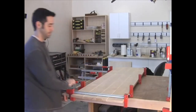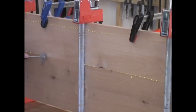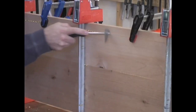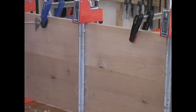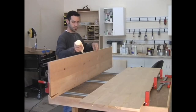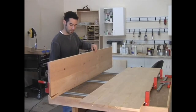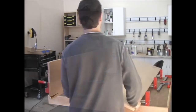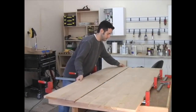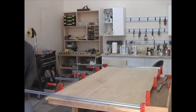I add a few extra clamps for good measure. I find the best way to remove squeeze-out is to wait about 30 minutes after the glue-up and scrape it away — no stain-inhibiting residue. I followed the exact same glue-up procedure for the second half of the tabletop. After about two hours, it's time to glue the two halves together. I add a few extra clamps and let the tabletop sit overnight.